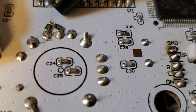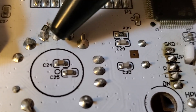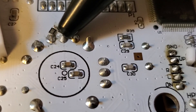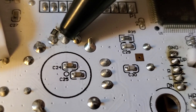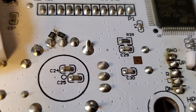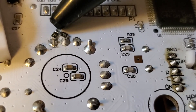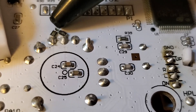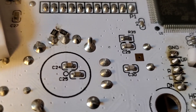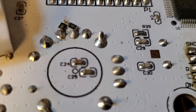What I'm doing there is I'm actually allowing more electricity to get from here to here. The center dot here is the readout pin from the joystick, so the amount of voltage flowing in there tells the controller where the joystick is located. By allowing extra voltage to flow along this path, what I'm getting is a bias towards that direction. The reason I use two resistors is just that I didn't have a single resistor that had the right amount of resistance.